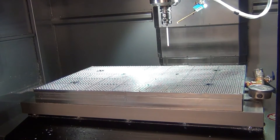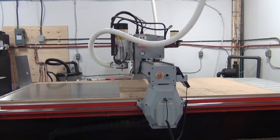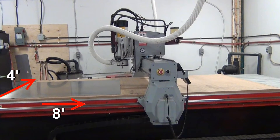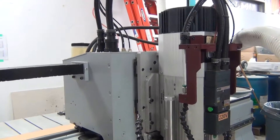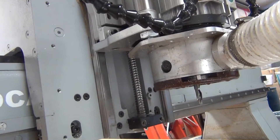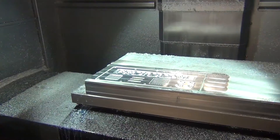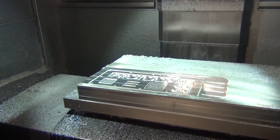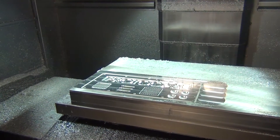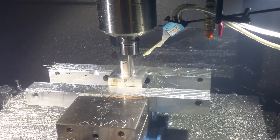Our machines are equipped with a custom vacuum chuck that gives a work holding envelope of either 26 inches by 16 inches by 12 inches, or 4 feet by 8 feet. Larger parts can sometimes be accommodated through multiple setups. The minimum sheet metal part that can be vacuum chucked without clamps is 5 inches by 5 inches. Vices can be used for parts smaller than 5 by 5.